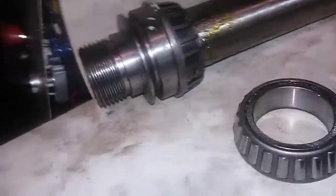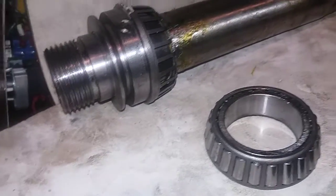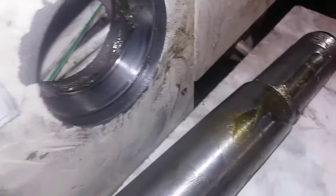The first time I pulled it out I just undid it without tightening it first. Anyways, I've got to find the right size tools - I'm going to take the outer races out and tap those out so I can put the new ones in. They sent me new bearings to go along with this, so I'm just going to start fresh with the new spindle since I have a new one here.